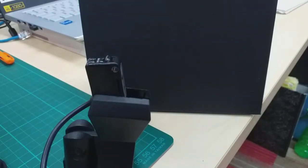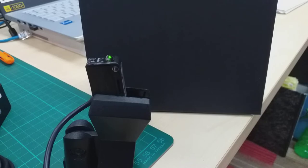So I connect to it. This sensor is NPN sensing. If it is dash P, it is PNP. BJ1M dash DDT dash P means PNP type. This one is NPN type. Okay, this one is light on.